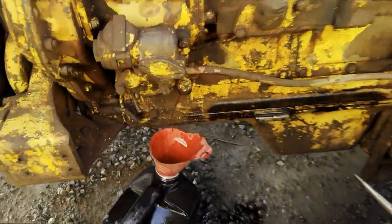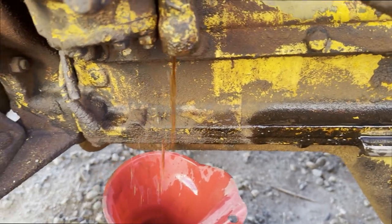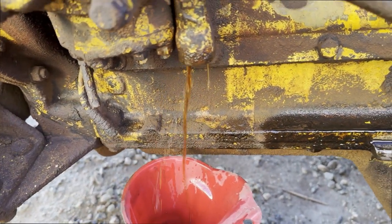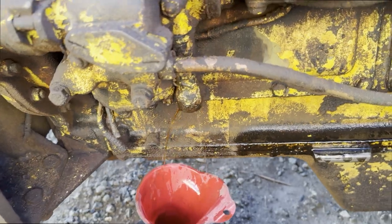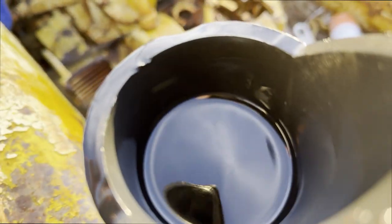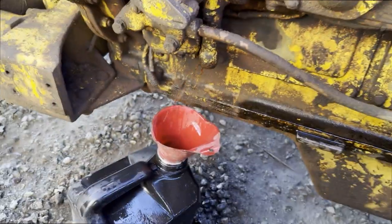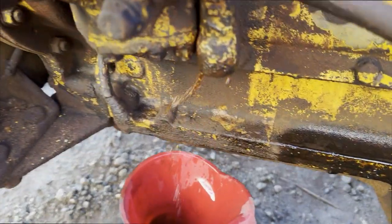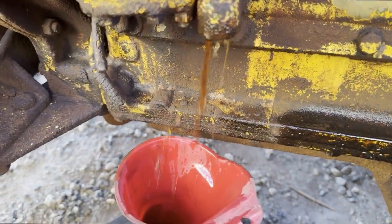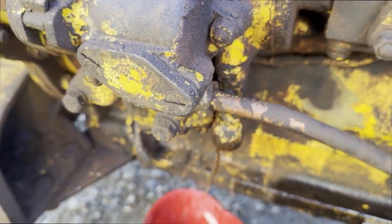Well, I poked the screwdriver up this hole and this black nasty tar came out, and then suddenly all this old fuel started running out, which is the beginning. I managed to slip a hose over here. It's still full of diesel, and this should actually just run all the way down to here, but it's not. So I'm wondering if this line is out. But at least the sludge was at the bottom. This is just old fuel that's obviously draining, which I'm very happy about.